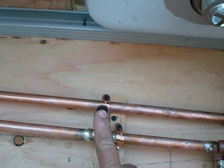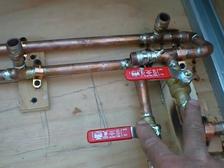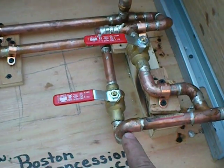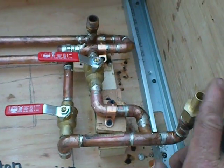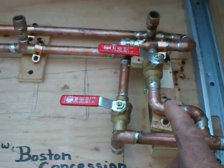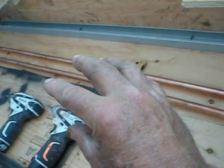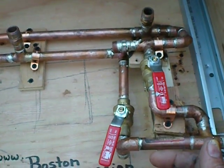feeds the second sink, and then it continues on and comes down to a valve. Hot and cold, each taper, they're sloped down to these 2 valves. These 2 valves tie into one primary line, which will as well have a barbed fitting to a drain hose. So in areas where freezing occurs, you will be able to open this port, and drain all of this water from the water heater all through the lines, down and out. This is what we would recommend.